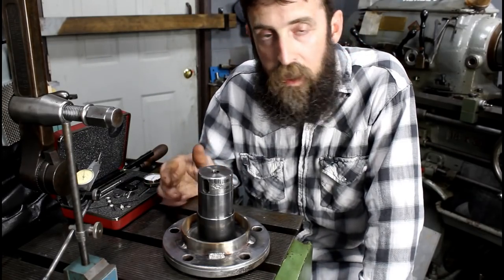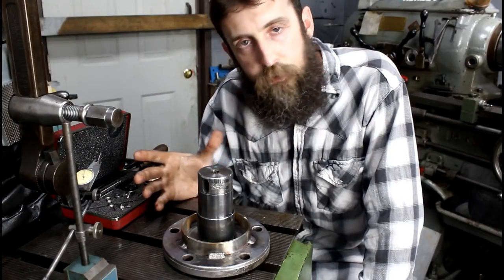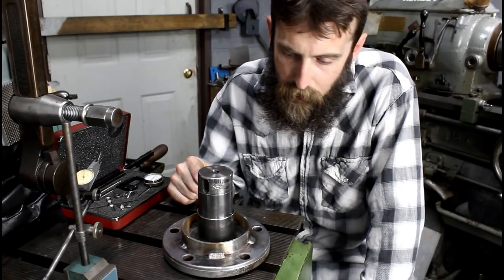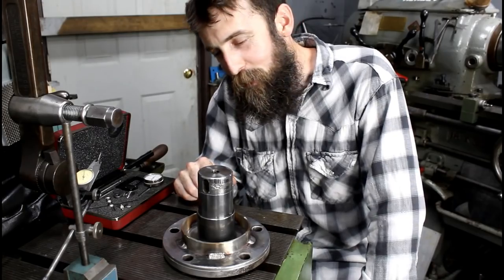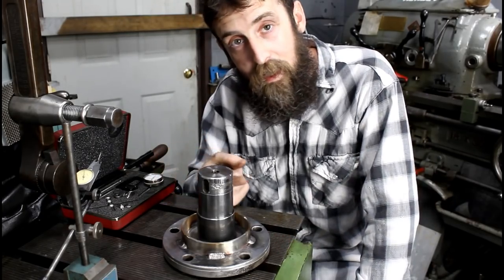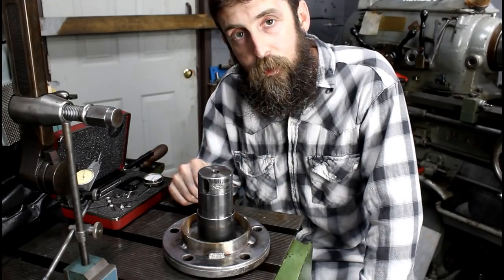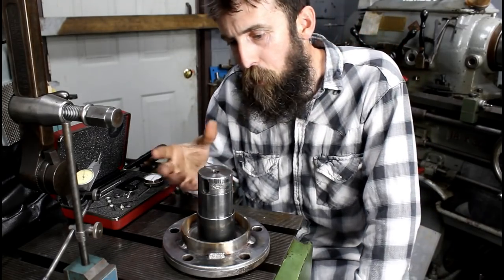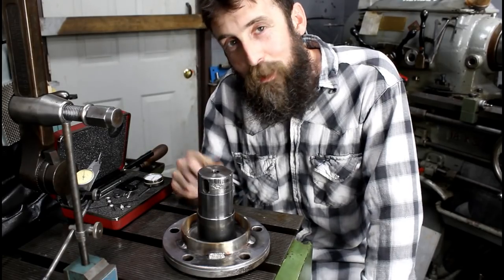I think it turned out pretty good. That was seamless tubing that we used off of a hydraulic cylinder. That's the body of a hydraulic cylinder. So perfectly capable of handling what we done. The ring turned out real nice. The welding's good, and we hit our numbers. So you can't beat that. For something like this, not easy to get and not cheap, repairing a shaft is a good alternative to buying one. It's still kind of eat up out here, but from what I'm told, that probably won't matter. So it's good to go.